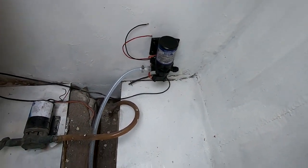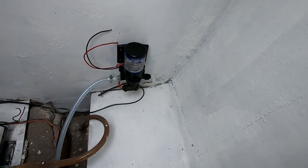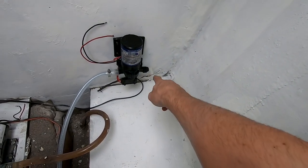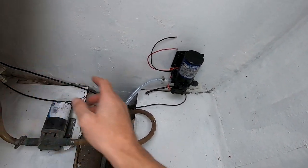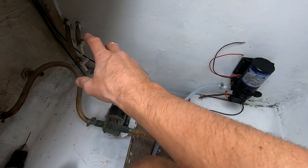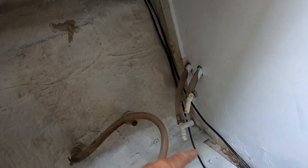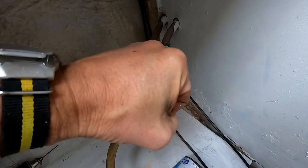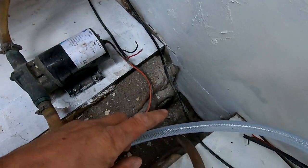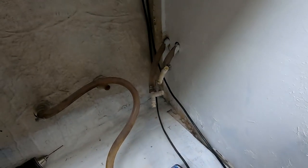Okay, that's my first bit of plumbing installed. Back of the tank, it comes down, down, down, down, down, into there — boom. Now all I've got to do is, I can go straight from there and do all the JG-type push-fit stuff. I want to redo with push-fit fittings as much as I can and then adapt onto these. What I'm hoping to do is get the push-fit stuff to come down all the way over through here, then put the push-fit fittings onto a bit of 15mm copper pipe, heat up the 12mm hose, and push that over the 15mm pipe and clamp it on. Should work.